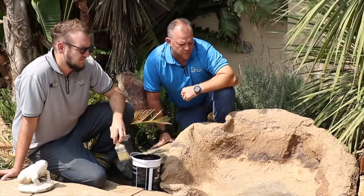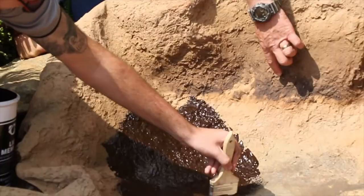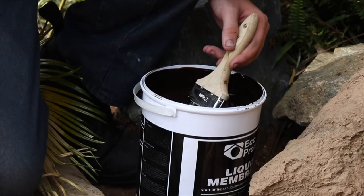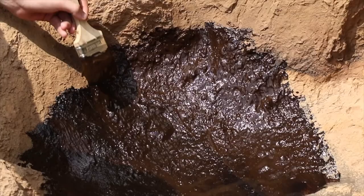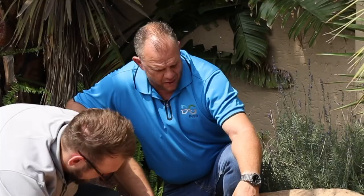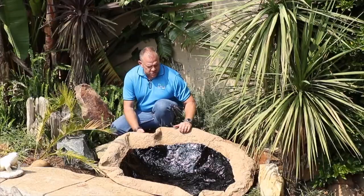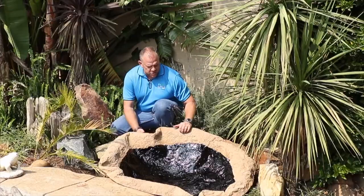We are going to seal a little fish pond. The product we are going to use here is your heavy duty product. The excellence about this product is it can stand in water, it is non-toxic so fish can swim in it, and you can also use it for drinking water. This is the same product you can also use for your box gutters, koi dams and farm dams. The surface must be nice and clean and then we will apply the heavy duty product inside it — make sure you get into every little crack. Give it one coat, let it cure, and that will give you a good indication of where you have missed something, then you can do a second coat. It's best to leave it for about 24 hours to cure properly before you apply water. Make sure the level of the rubber is always higher than what your water level is going to be. Now that the heavy duty product has been applied in the fish pond it's already starting to cure — leave it for 24 hours and you can start putting in your water.